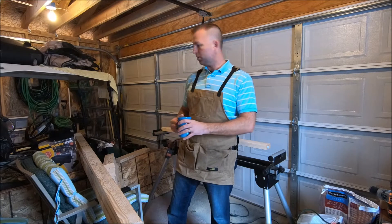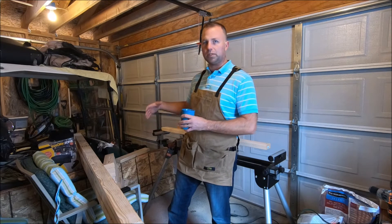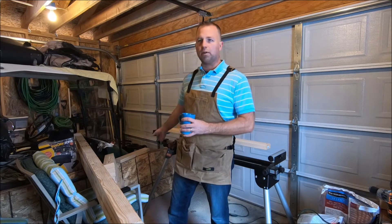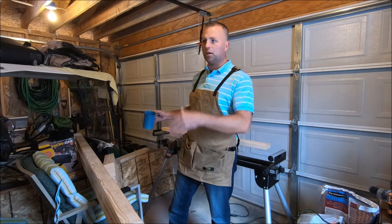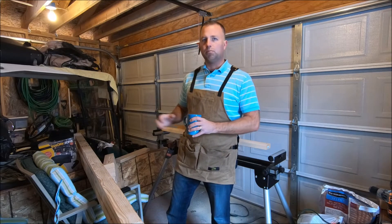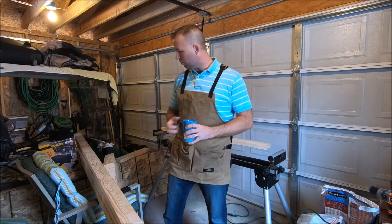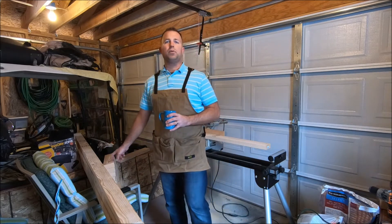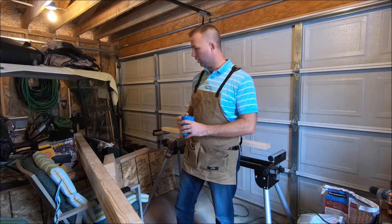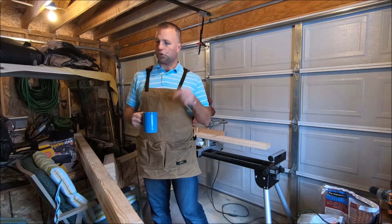When you go to get boards — these boards back here are all plywood that I had cut down lengthwise in 2 foot sections. When you're at Home Depot you buy the plywood, it's like 10 bucks a sheet. They'll cut it right down for you there. We'll still have to cut them because I've got to cut two 4 foot pieces out of that to make the 12 foot section. But that's a nice handy thing because Home Depot will cut it for you — some of them might actually cut these pieces for you if you're building the same thing. Just tell them you need a bunch of 21 inch pieces cut and they'll cut them for you. So we got all the wood here, I'm going to finish cutting this, and then I'll show you how we put these together.